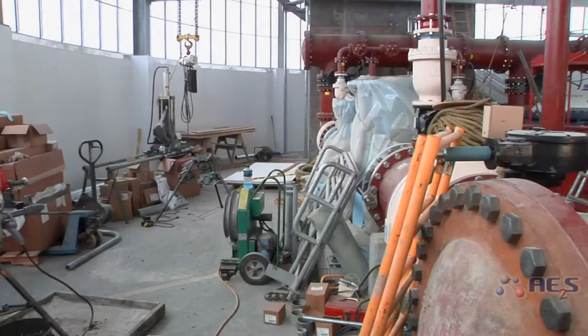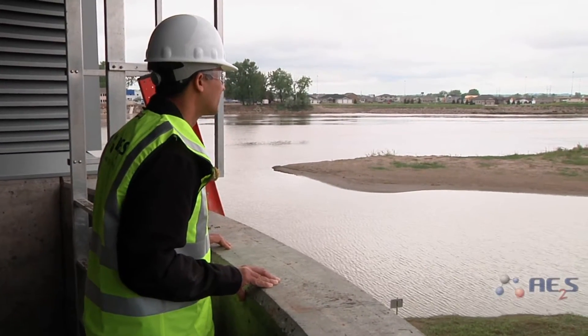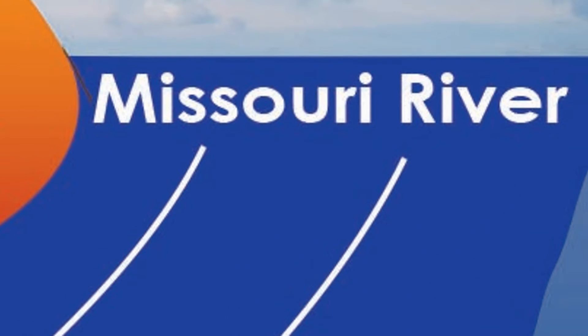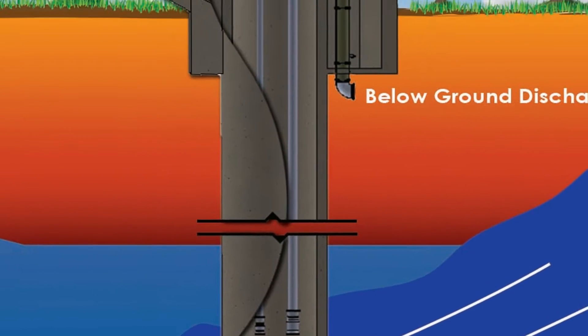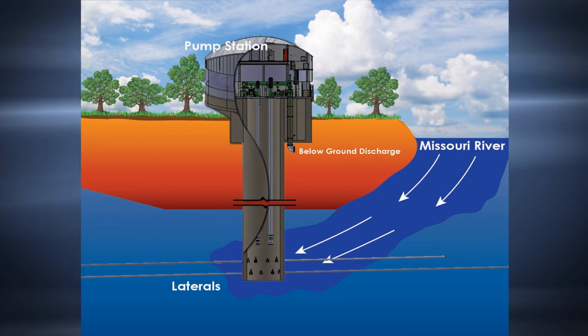We'll let Leith explain a little bit more about what this place is all about. This is going to basically turn into the new water supply for the city of Bismarck on a primary basis. Right now they've got an existing surface intake that pulls water, kind of like a straw or a vacuum, directly from the river. Once this goes online, the city is going to benefit from 60 feet of sand that's going to help filter anything that happens to be floating in the river out. So you get spring runoff events — say you get four inches of rain in a week and everything runs off into the river — that has a big impact on how they operate the plant and the difficulty with treating the water.